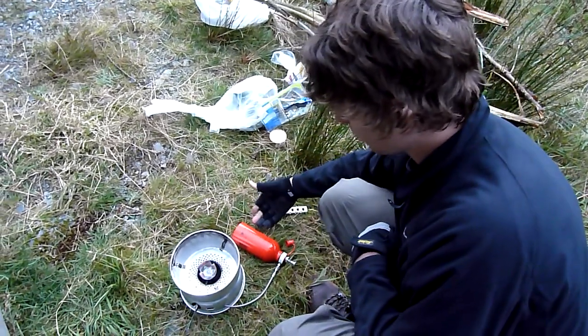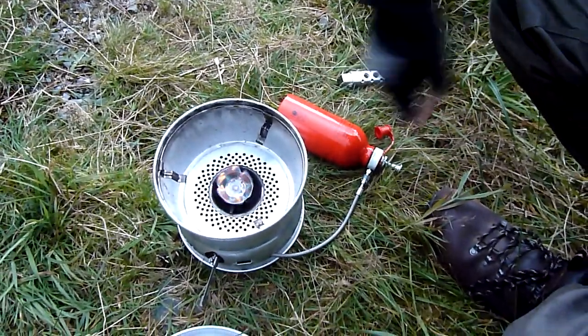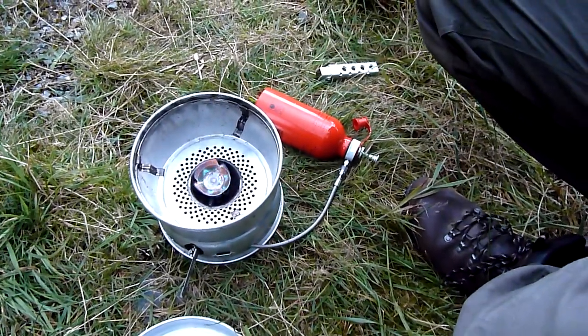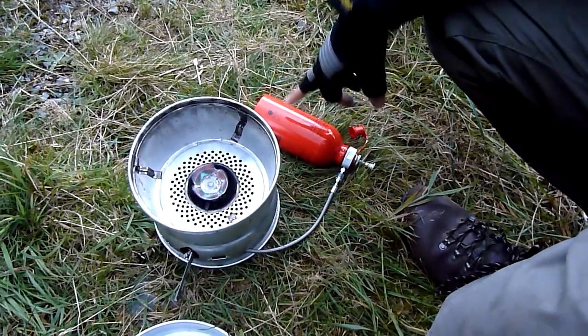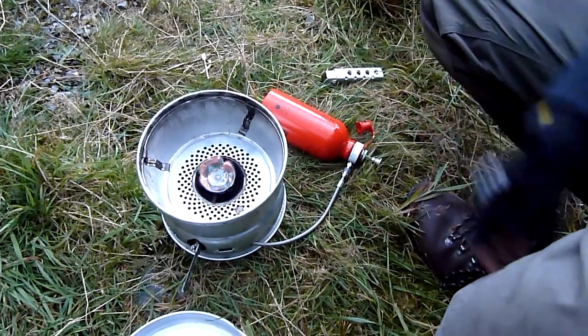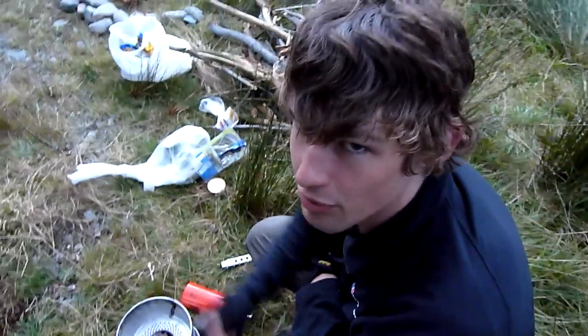When you're done, you flip the bottle over. It still burns for quite a while as the fuel's coming through, and then suddenly you hear a hissing and all the air comes out, and it depressurises the bottle — which is handy. It's much safer to carry like that, and also cleans the needle — the injector needle. Right, that's about it. Hope it's been helpful.